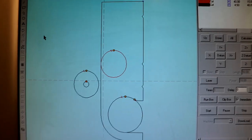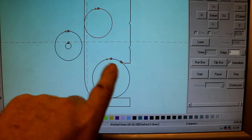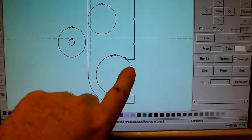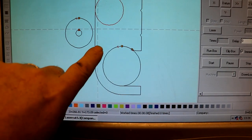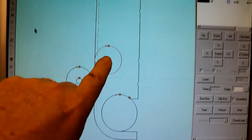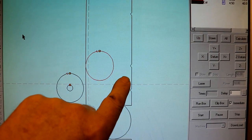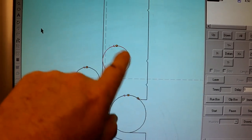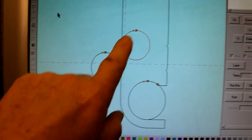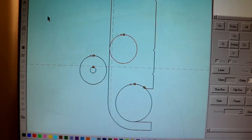New design at the ready. Changes I've made are to make this ever so slightly smaller so it grips the pressure cylinder a little bit better, make that about a millimetre thicker so it doesn't distort so much, move the holes over to the right by a millimetre, take that hole out of the middle and mark it, draw a line and then cut out this bit which you'll stick on there, and then that'll be the guide for the tapping and drilling.